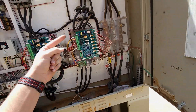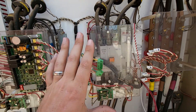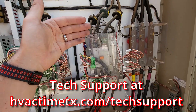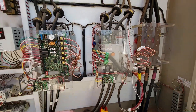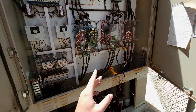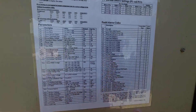We're still struggling with this one. We didn't change this board — this is a retrofit board that was in here. This original board is having a no line voltage alarm and we don't quite understand why. We've got voltage input everywhere it needs to be, but it won't recognize that it has voltage. Maybe that board was bad, but we've never seen this circuit run since we took over. We were getting the NOL — no line — and we were throwing an F28, which is no line voltage alarm.